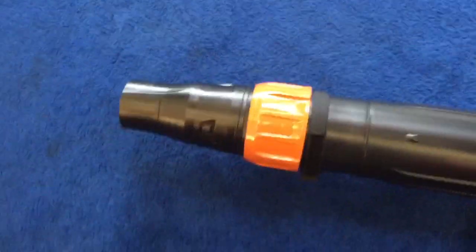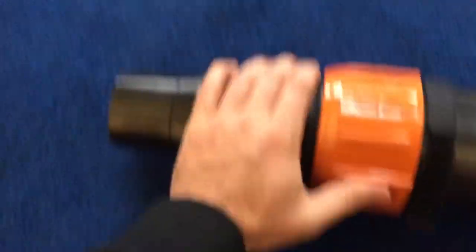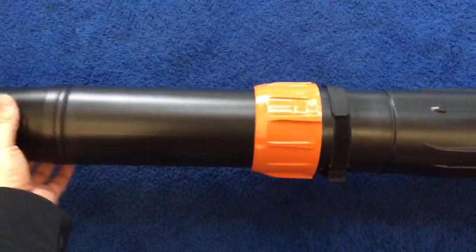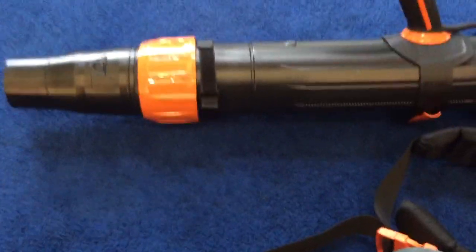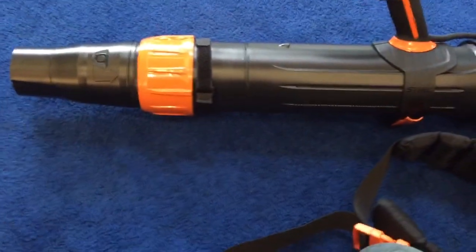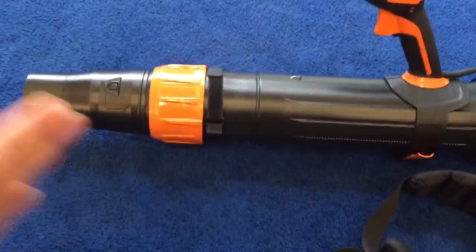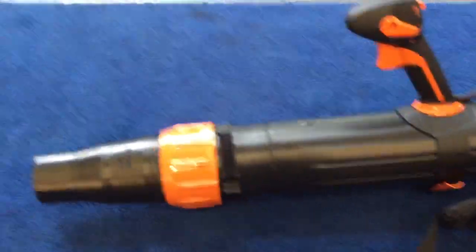This thing has a couple of cool features I really like. The adjustable tube length uses a locking collar — you loosen it up and the length is infinitely variable. That's nice when you're working in a tight space. At a short length you get slower airspeed but more CFM; at a long length you get higher airspeed but less CFM. You can adjust it on the fly without removing pipes.